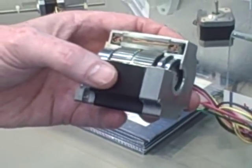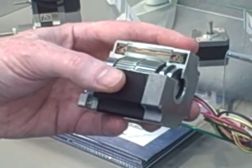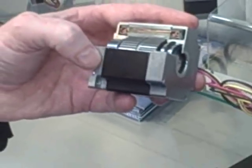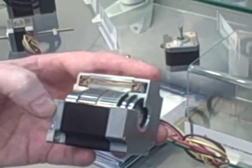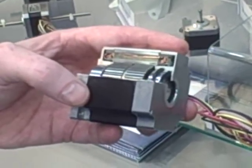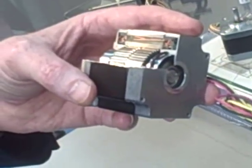We use the Aluminium Tube to align the laminations and also to provide heat sinking — to act as a heat pipe to push the heat to the end bells and draw heat away from the motor. In this way we can have either higher torque for the same current, or lower heat for the same operation.